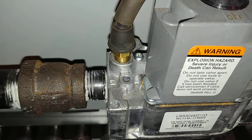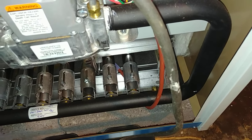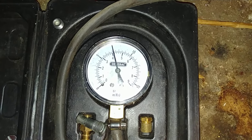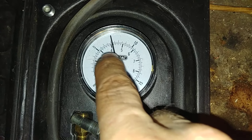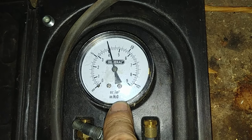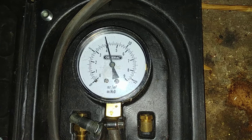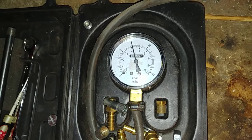This is the upstream plug. I've got it removed, and I've got a hose attached going to a low-pressure gauge. The inner scale is in ounces, so we've got a little over four ounces. But generally, we measure in inches of water column, and as you can see, that's seven inches of water column, which is about the range we would expect for an older gas supply system.